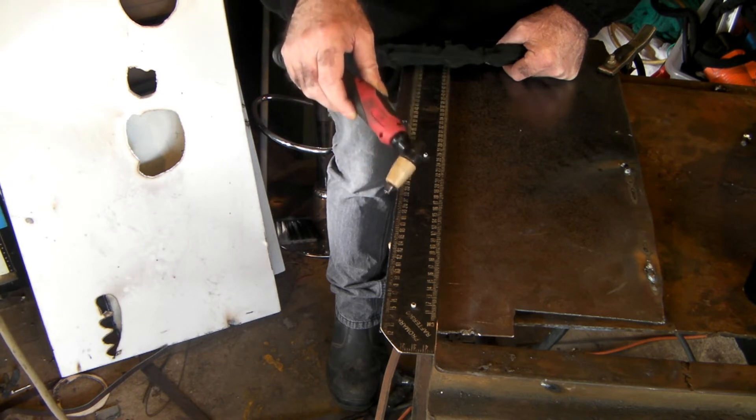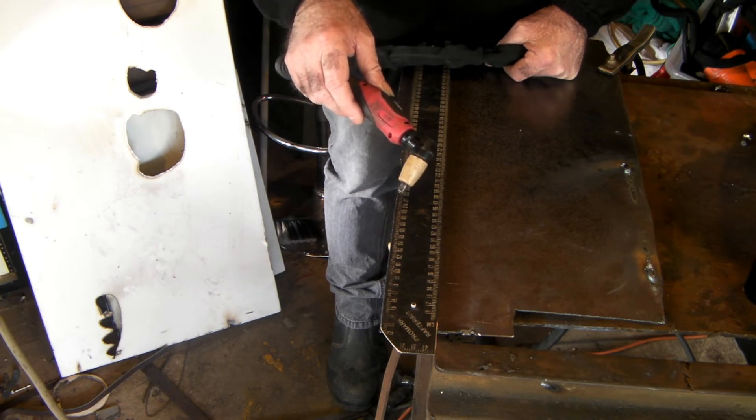But you still need to have some eye protection. Like I said, you need some eye protection because you'll live to regret it, trust me. So guys, when I'm plasma cutting, I just use glasses like this. Because I find that the old welding helmets with the shade of 8 to 13 is really too dark for plasma cutting. So I just use the little glasses, and it's only shaded from 3 to 5. But it just protects your eyes enough, and you don't get the blowback glare, and you don't get your welding flash of course.